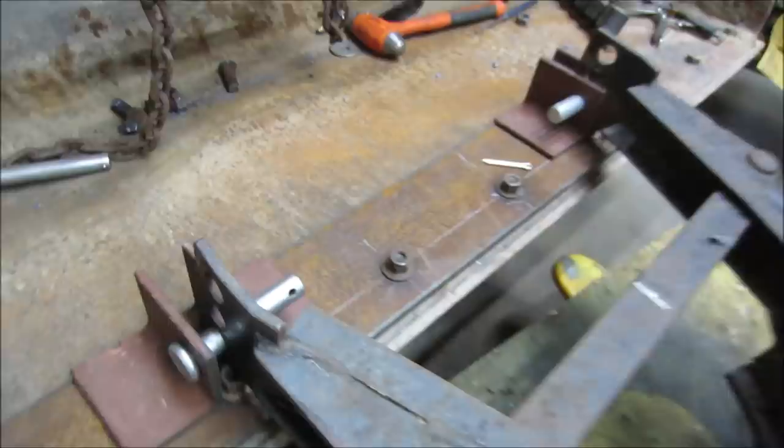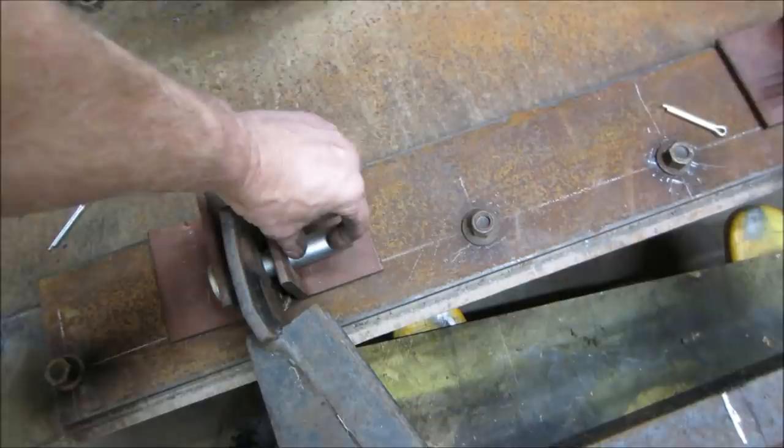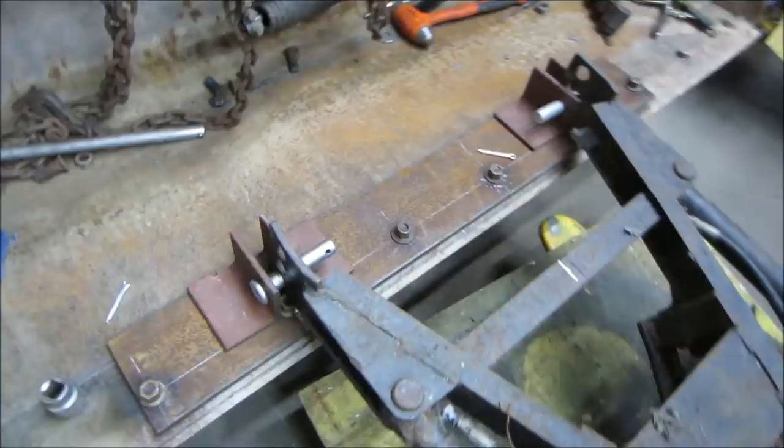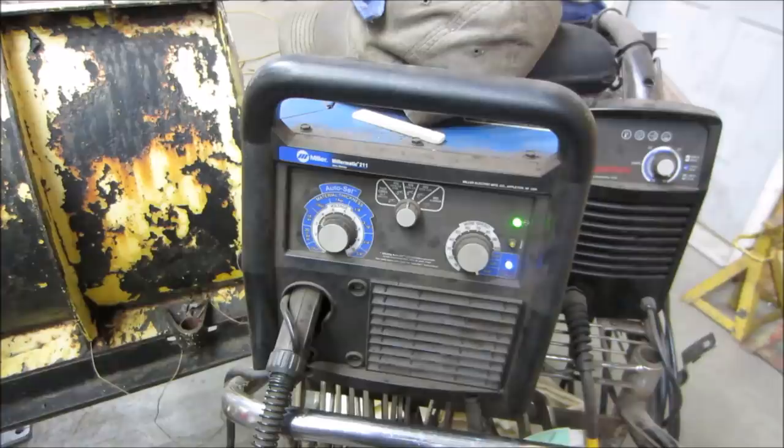I like it. We could also, if we find it's a little too sloppy, probably put some shims in on the sides of the pin, and probably should take something to take that slop up, huh, and then put the key in it. Take a piece of pipe or something, we'll cut it, we'll slide it on there, and then put the pin in so the pin's not walking so much. Getting there. That's some thick stuff. I'm gonna have to turn her up to 11. Peg that puppy.